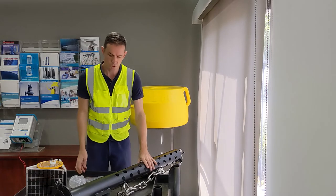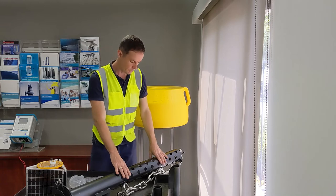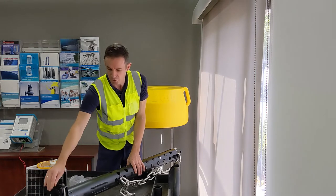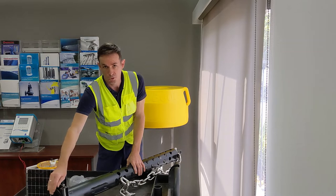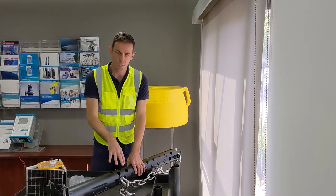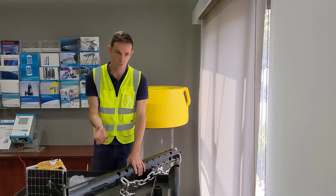The instrument tube goes down the centre of the DB600. It has a chain cable tied to the body of the tube and a mounting plate for the AR-1 on top. You will need to cut some cable ties to get those pieces out — they're just held in place with cable ties for shipping.